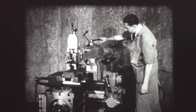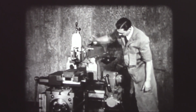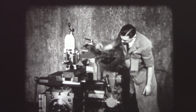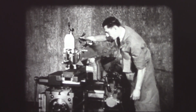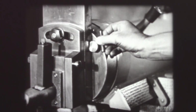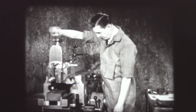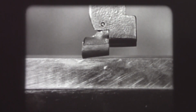On the forward stroke, the cutting edge of the tool stops about 1/8 of an inch beyond the edge of the piece. On the back stroke, clearance is about 7/8 to allow time for the feed to operate before the tool strikes the work. The tool is now set to the work. Note that the heel clearance of the tool is about 6 degrees.